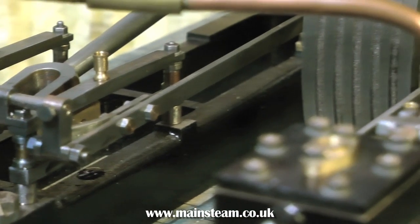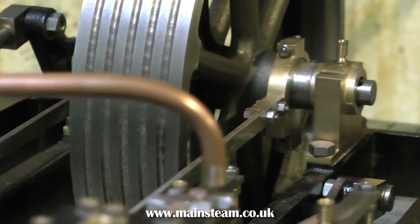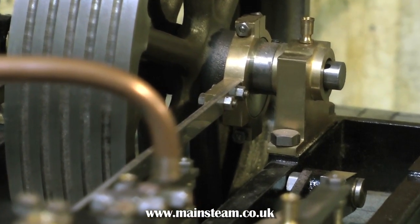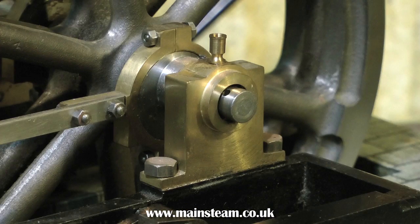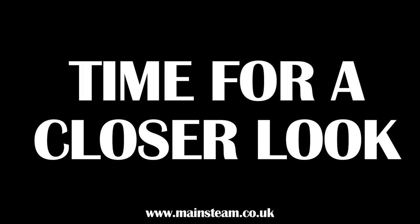When it comes to fitting the parts together that you've made for an engine, if the parts aren't made well enough, then the builder's going to have to bodge it when he puts the engine together. I somehow get the impression that more than one builder was probably involved, because the meticulous, painstaking finish on the cylinders is not duplicated on the main bearings — and they're not even split. Split main bearings make it possible to adjust them to take up any wear, and that's what's shown on the original Stuart drawing.